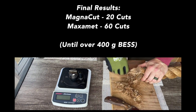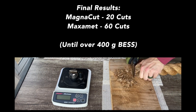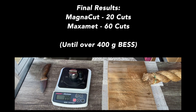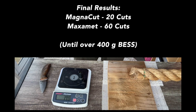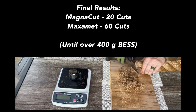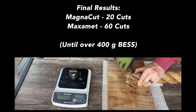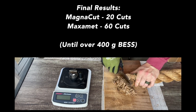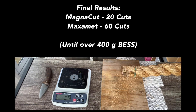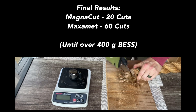That is the best reading that I have had so far by a solid 50%. The previous best reading I had ever had was from Blank Blades — my friend Jason sent me some 10V at 66.5 Rockwell in a really thin behind-the-edge kitchen knife, and that cut 40 times through this 40mm manila rope, which absolutely boggled my mind. And this has done half of that over again, to pull a final number of 60 cuts through this massive rope.